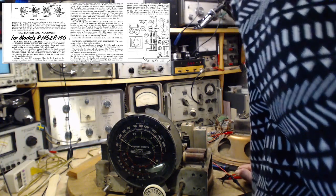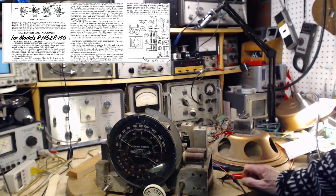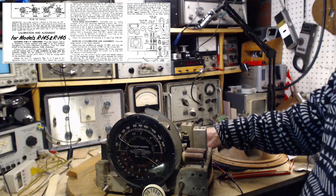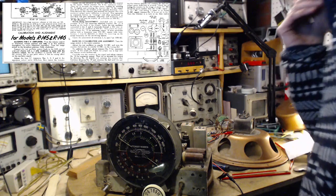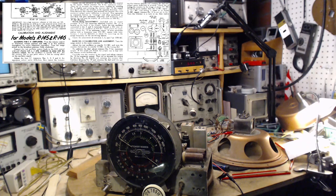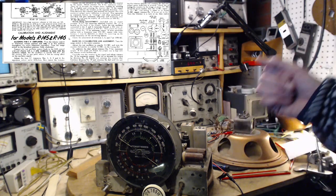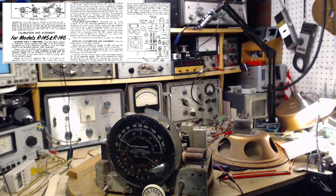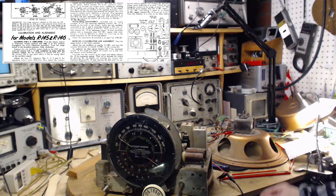How come? It sounds like it's trying hard, but admittedly, my outdoor antenna is really lousy. So what have we got? I have a loop antenna designed for use with a radio like this. The radio is designed for a dipole antenna to be installed, especially for the high shortwave band. It doesn't say anything about a loop antenna, but I think if I hook the loop up between the regular antenna input I'm using now and the chassis, we'll have a loop working for us.